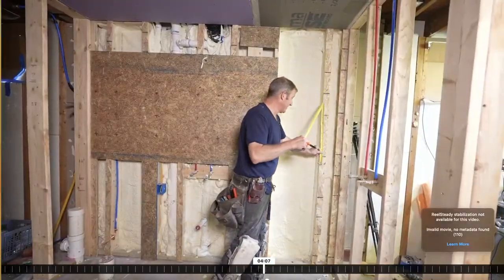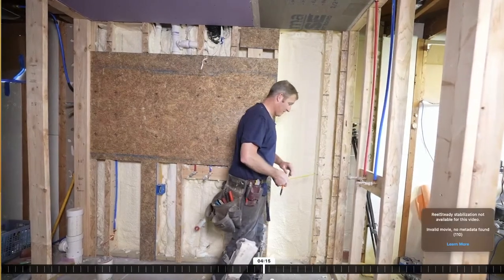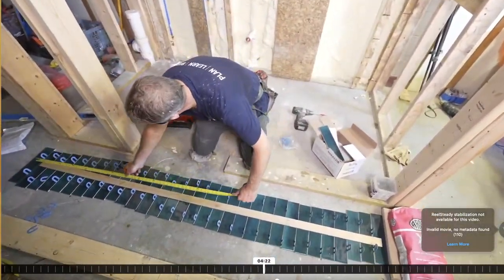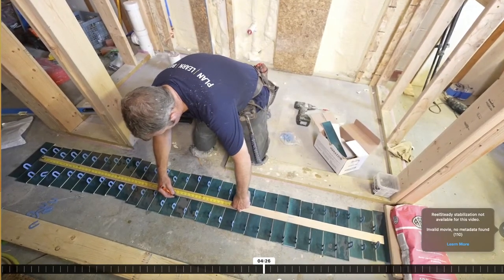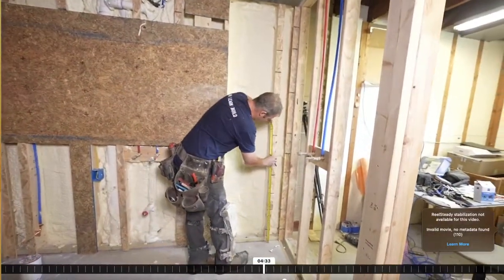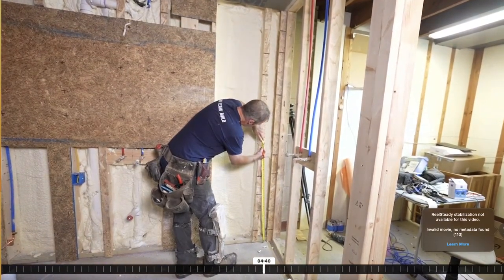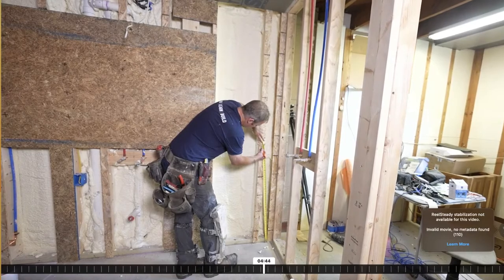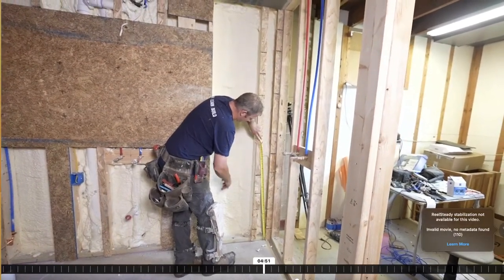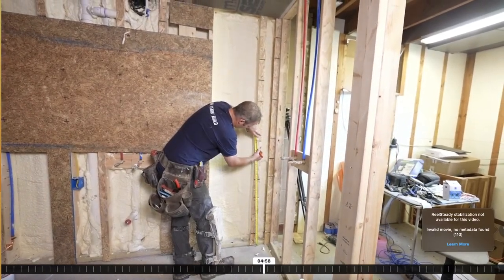Okay, so we're just going to go 16 tall. It's not going to be overly tall, but it's going to get all of your accessories comfortably. If we went with 42½, we need to reference where that is going to be on our grout joint, and that works out pretty well because it comes right at a grout joint. My recommendation at 42½ is you need to account for your tile. We'll say 3/8 with thin set, and we'll just make it 1/2 inch with thin set to make it easy. Then we have our backer board, and then our countertop on top of that. So basically 1 inch minus below your 42½ mark.